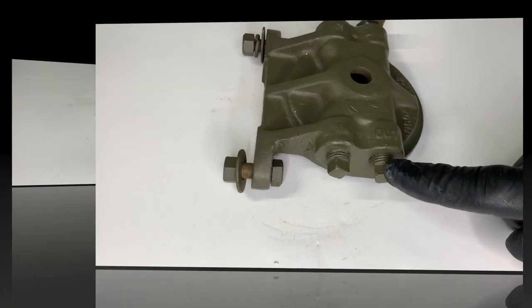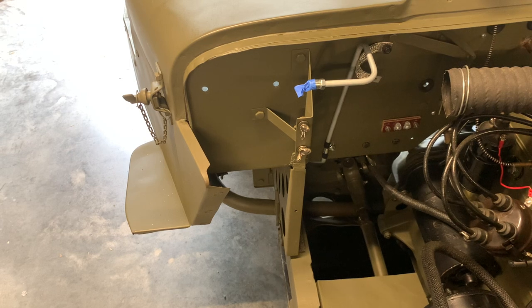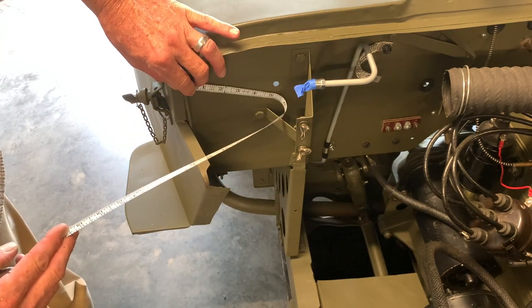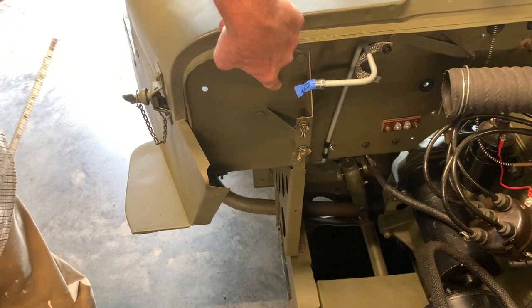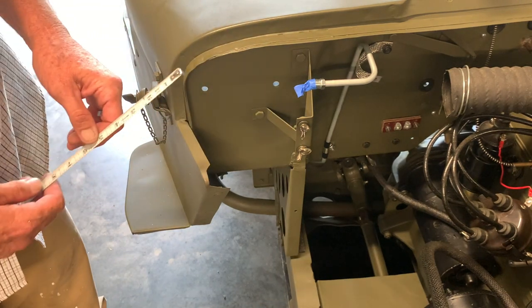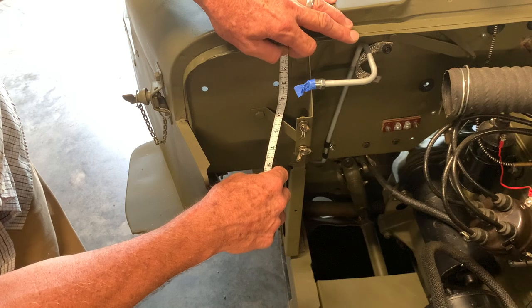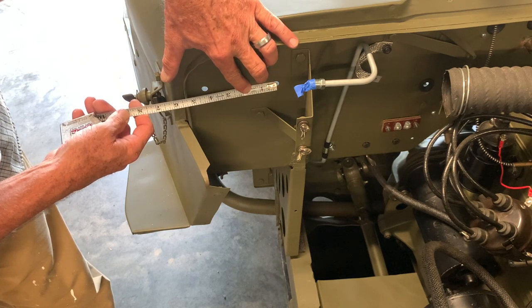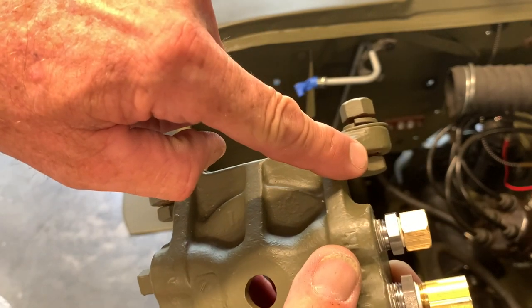The pipe plugs are quarter-inch pipe plugs that I installed way back when I sandblasted and painted this — I already put the sealant on and painted them. Looking at the location where the fuel strainer goes on the tub: if you measure down from the inside of the rib on the tub, you'll find a measurement of 2-7/8 inches, then come over from the opposite side square and it's 5-1/4 inches for that first hole. The difference between the two holes center-to-center is 4-3/16 inches on a level line. It's a little difficult to get your measurements in there because of the radius. The drill bit size for the hole is 13/32 to accommodate the 3/8-inch bolt.